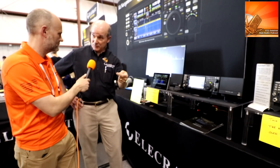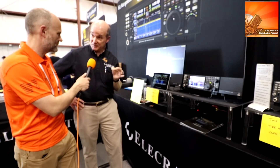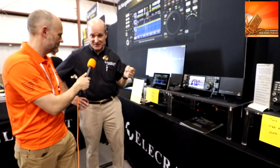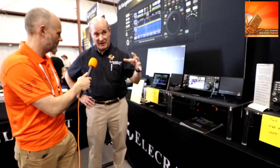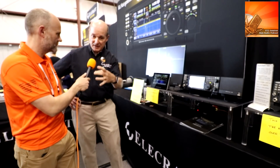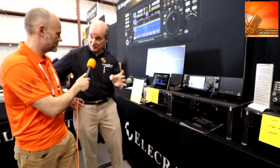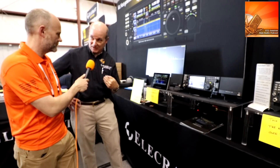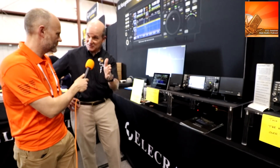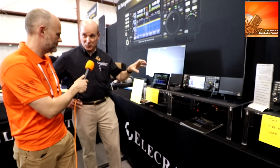The K4HD will be coming out a little bit later as an add-on — and you can upgrade from one to the next. The K4HD covers extreme cases: when you're contesting with multiple transmitters on the same band at the same location, on a DX-expedition, or extreme situations like you get in Europe in some cases. It adds a K3-style super-heterodyne hybrid front end. We convert down from that to an 8 megahertz IF. We have pre-built, already-installed crystal filters for a sideband and a CW bandwidth on each of the two receive channels. And then we direct sample right off of that, and everything's the same on the back end. The advantage is that direct sampling method has much more dynamic range even than the old K3 did after its filters.